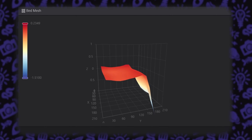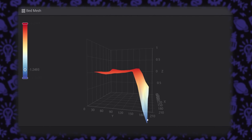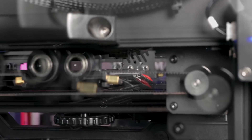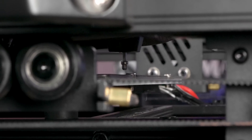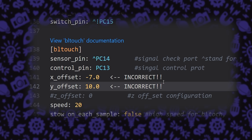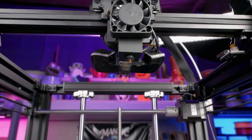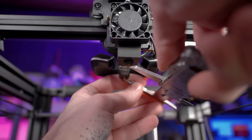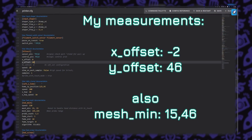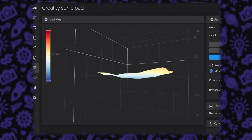I wanted to take a look at the bed mesh and make sure things were reading properly. It was pretty evident there's a problem — there's a big cliff drop-off where there's over a millimeter of variation at the back edge of the bed. I ran another self-level so I could watch the probe in action, and sure enough, the probe at the back edge of the bed is off the edge of the bed. The offset for the probe in the BL Touch section is listed as negative 7 on the X axis and 10 on the Y axis — that's where the probe would be if this was a stock Ender 3 with a BL Touch kit. I manually measured the distance from the nozzle to the probe tip on the CR Touch and found it's about 2 millimeters negative on X and 46 millimeters positive on Y. With the probe parameters corrected, I was able to get a proper bed level reading and move forward with printing.